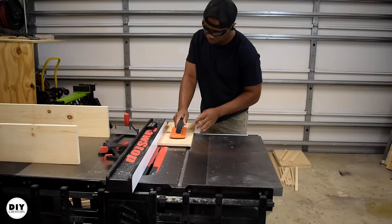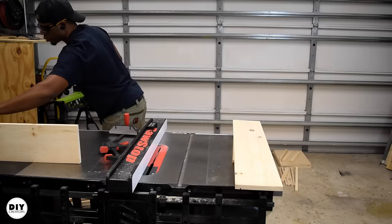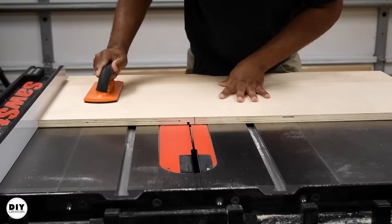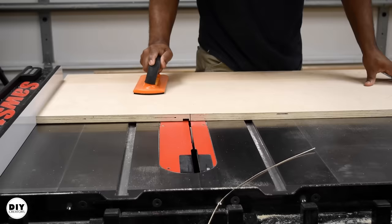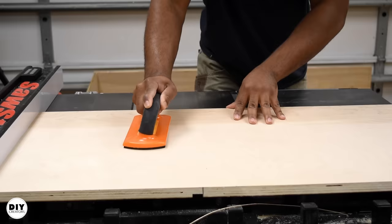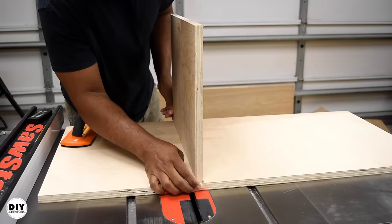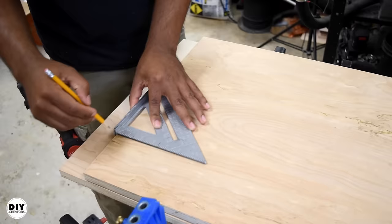With the drawers being cut to the final dimension it was on to making a slot for the drawer bottom. The middle divider had me spinning my wheels for a while because I was trying to think about the best way to go about it. I went for the dado joint here — this may have cost me more time up front, but it ends up being an easier join during the glue-up with less alignment headaches. You could use a pocket hole jig for the connection and just plug the hole, or just use screws from the top and bottom shelf and plug those as well. To be more efficient I marked all the parts and took care of the prep work, like drilling the pocket hole screw locations prior to assembling.